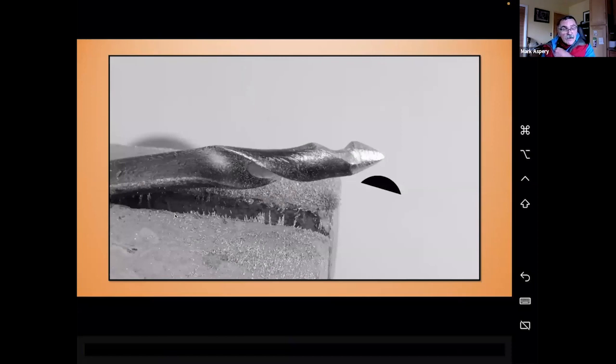Are you limited to a half round file? No. You could use what I call a 3-square file, which is your triangular file. You could use a ward file. I think those are called knife files these days. All I'm trying to do now, if you can see where my half round was, or the twist and it ended, I'm just chasing along here, and I'm trying to chase at a certain angle.